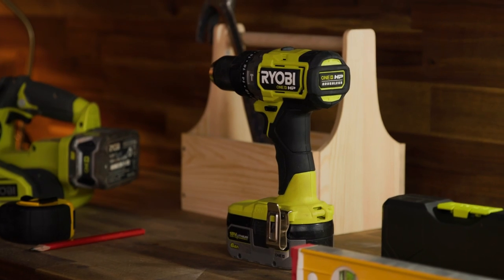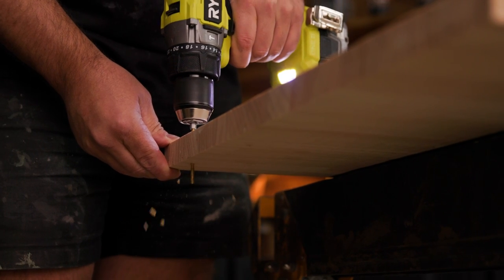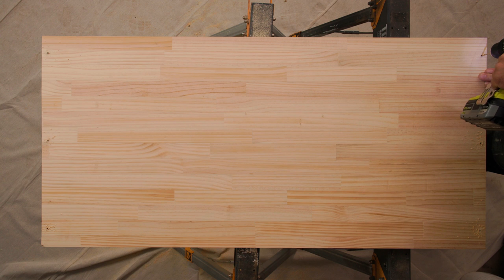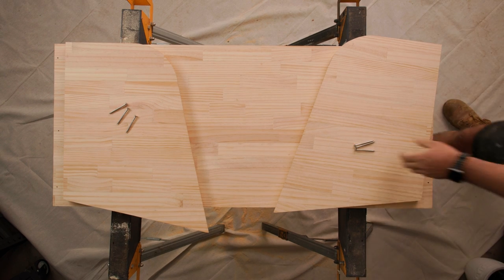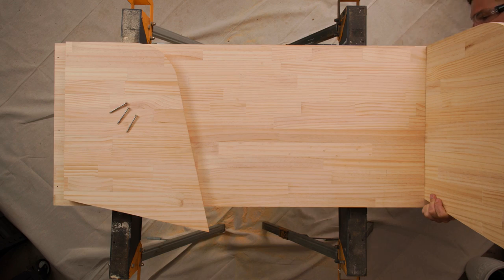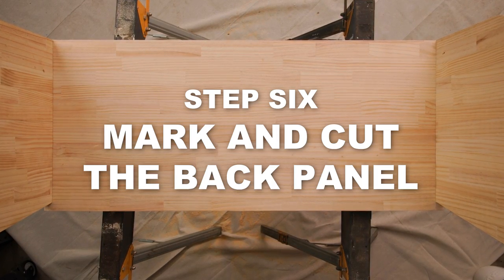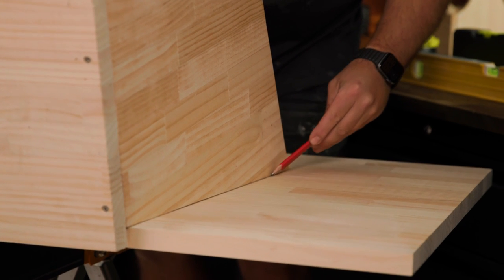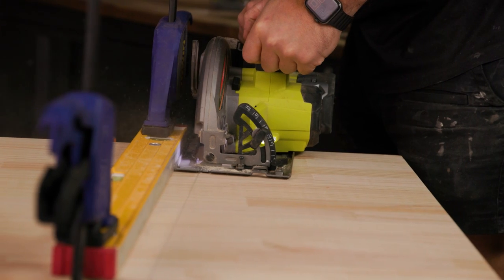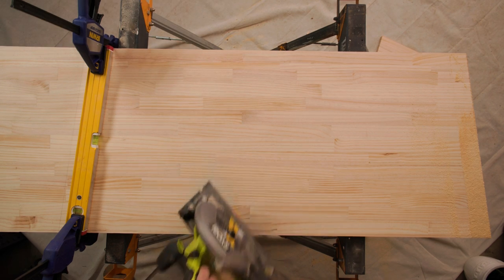Using the 18V 1 Plus Drill Driver, pre-drill 4 mm holes into the base to allow you to screw on your sides, approximately 100 mm apart. Once the sides and base are screwed together, lay this over the remaining piece of project panel. Trace an outline onto the panel as this will ensure your back panel is the correct size and length of your arms. Use your circular saw to cut along the lines and insert it in place to check that it fits.